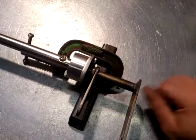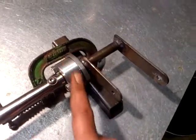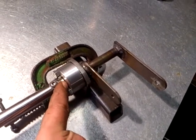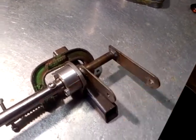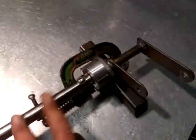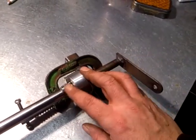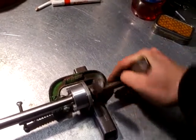Forget these pieces. This is just so that I can demonstrate it to you. So what's in this bit then? So this is an aluminium bush. Okay, I machined that up. Inside the aluminium bush you can just see a nylon bush, which is what this thing is actually rotating in. Okay, and then to connect the tube, this is stainless steel tube, it's about 2mm thick, but to connect that tube, which is essentially the cross shaft, to this end piece and indeed the other end piece, basically there's a pinch bolt, so it's drilled right the way through and bolted there so it can't come out. Okay, exactly the same the other end.